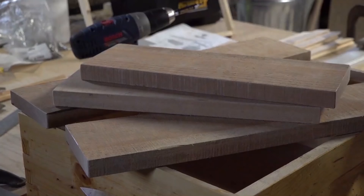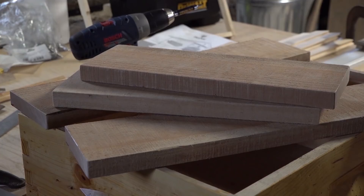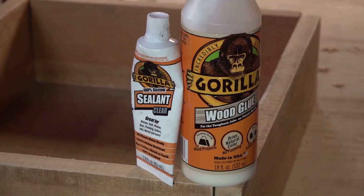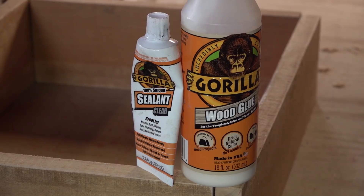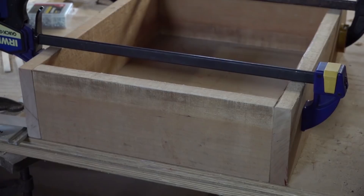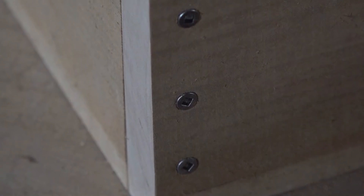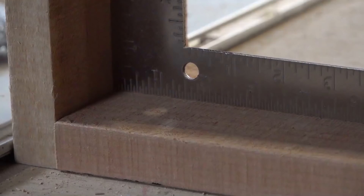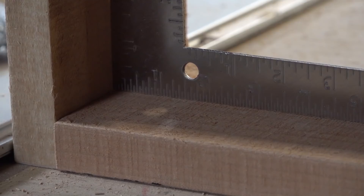Look at the rough-cut aspects of this wood — it's a really good insulator. This is just a feeding shim and these will stay on your beehives all year round. Get some really good wood glue and a clear 100% silicone sealant because we're going to seal all the interior joint surfaces to make sure bugs and mites can't hide. Here it is with the clamps on — squared up against that plywood edge — and we're using two-inch self-tapping stainless steel screws. Get the ones with the square drive heads or you're going to be putting a lot of money in your cursing jar if you use Phillips heads. We did put glue on here and we're verifying it's nice and square before moving on.